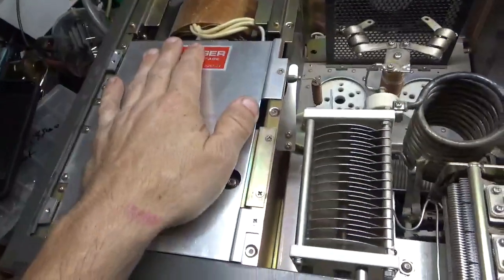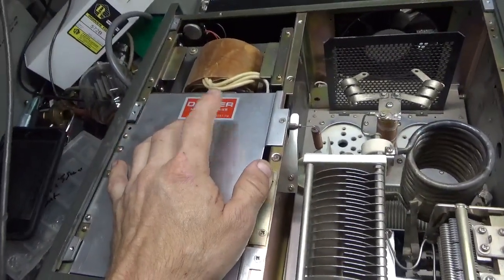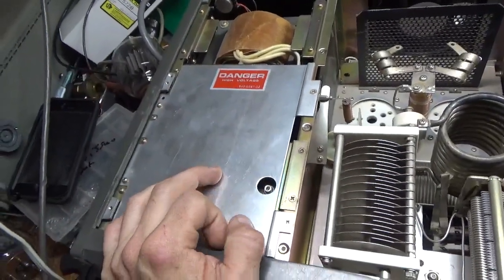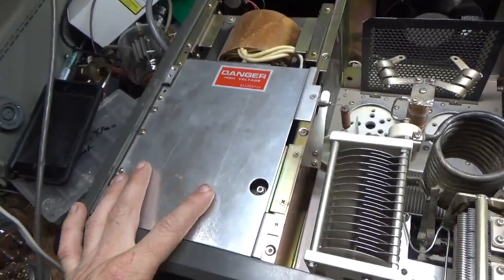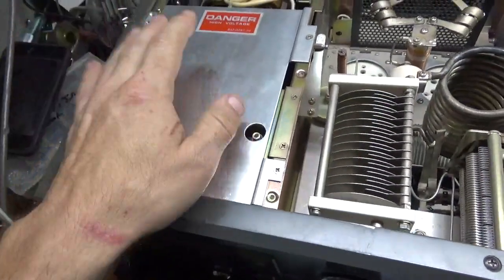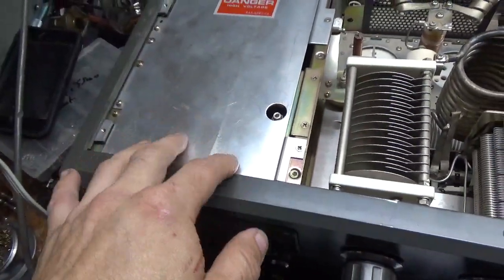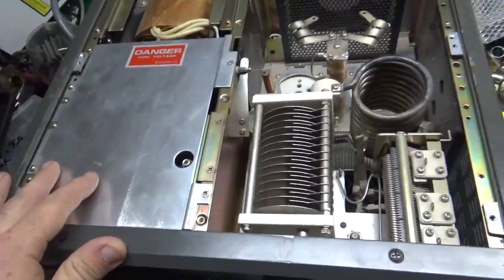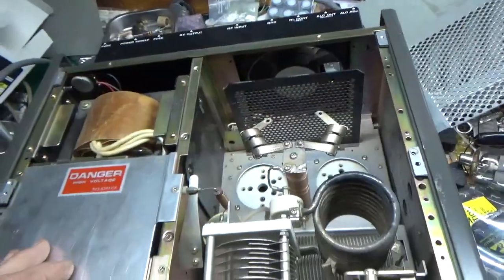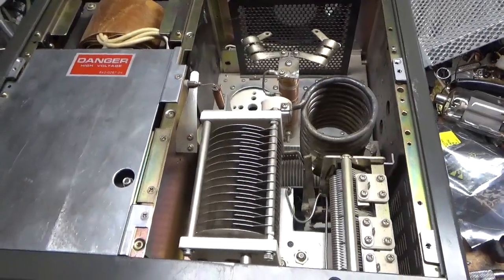The filter caps are usually fine — I've only had to change them twice. That was due to one of the resistors being damaged, which caused an unequal amount of voltage to be across that cap. Just look at the wiring and make sure it hasn't been hacked up — normally it's fine. If someone changed the meter lamps, sometimes they don't do a great job. Also inspect for any fan damage. I'll flip it over and show the bottom.